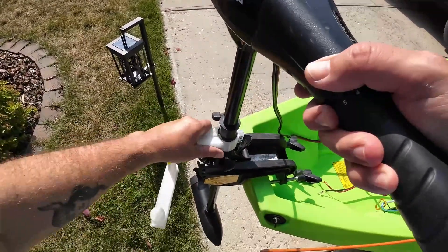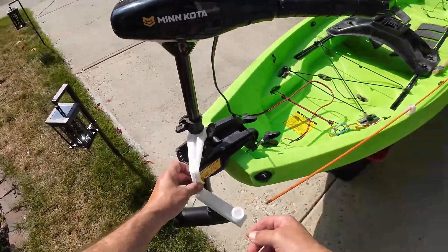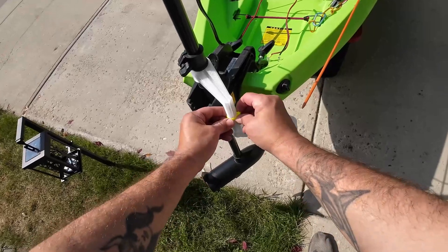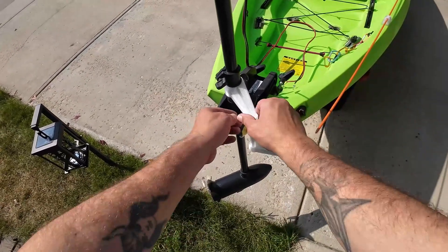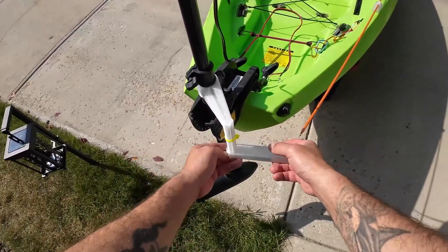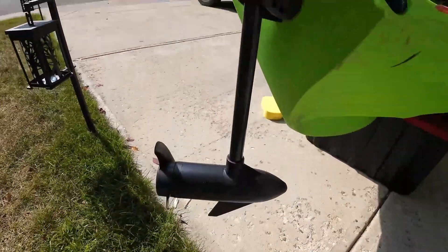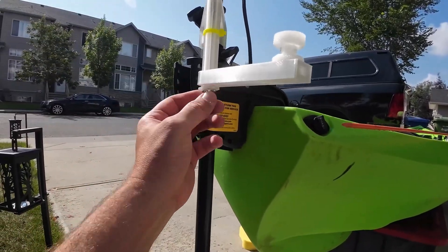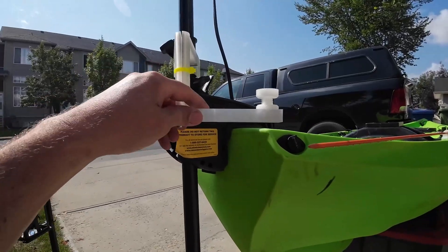There's a TPU insert — a flexible 3D-printed material — so I can get a good squeeze and this rod doesn't go anywhere or have any movement. The only downside is there's nothing at this point, so I just used a tie wrap. There's a little indent in the design to keep the tie wrap in place, which keeps this from spreading. Underneath there's a 3D-printed washer screwed to the bottom of these pieces to keep the piece from falling out.